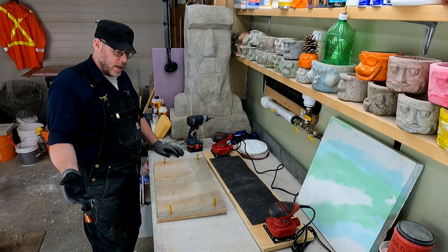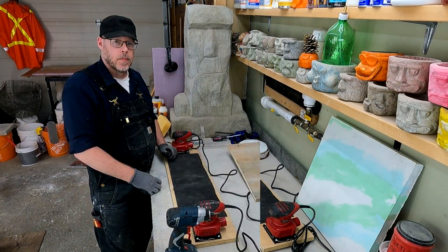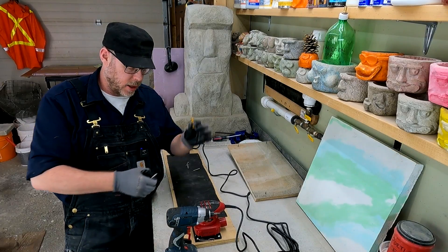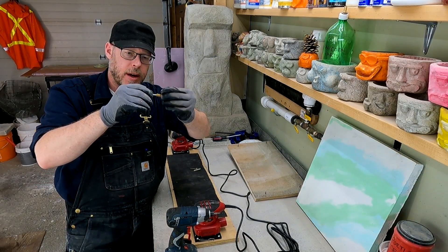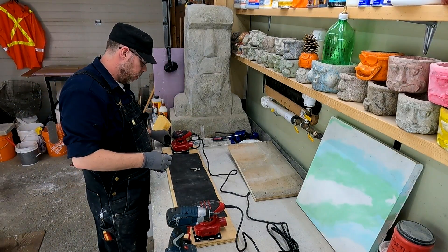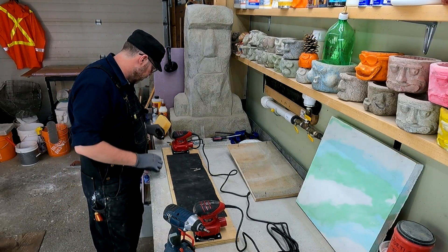That's the idea for the bottom connection. For the top mounting of the springs, it's a little bit different. I found something with a longer, more aggressive thread — I want it to actually hold the screw so it's not constantly falling all over the place. I've got pilot holes drilled so I should be able to just send this through.